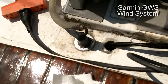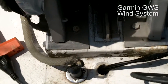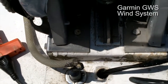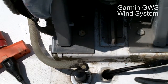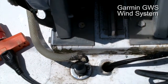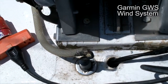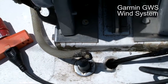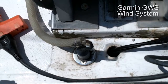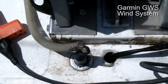Today is Friday, May 6th, back up at the boat trying to finish up the installation of our new instruments. We've got a Garmin system and we're trying to put the through-deck connector in now for the GWS wind system at the base of the mast. I got the hole drilled, got the mounting holes drilled, just put the sealant around it, getting ready to do the initial installation through the deck.